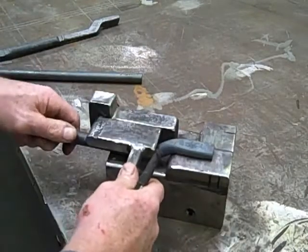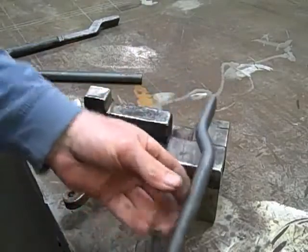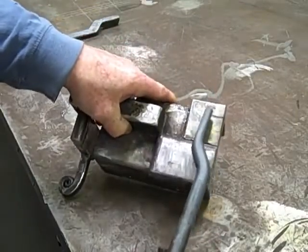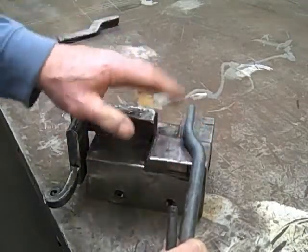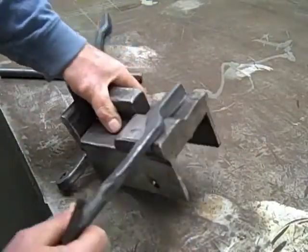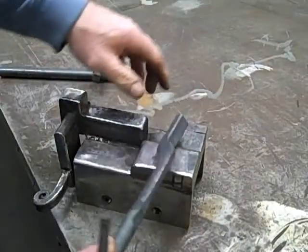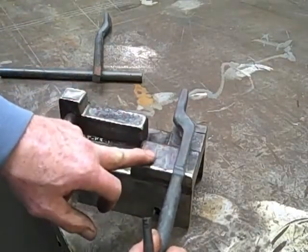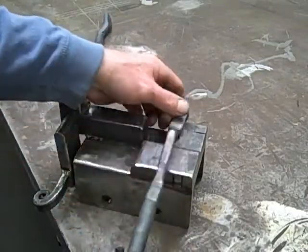The distance between here and here is about 5/8 of an inch also. After driving that down, I remove the arm. I take the piece we've just bent, and I'm going to put it on this block. I have another arbitrary line back here. I'm going to come into that point with the top end of the boss toward the outside and drive that down. The radius on this piece of the die creates the offset. Remember, there's only 3/8 of an inch difference between this block and the kiss block, so no matter what, I'll always have a 3/8 inch thick boss.